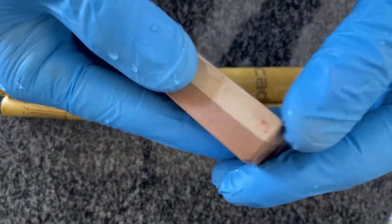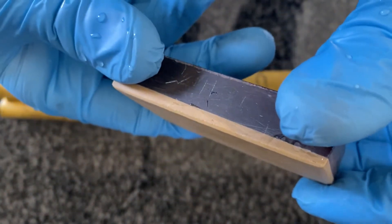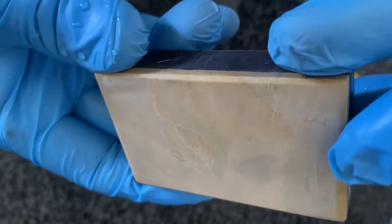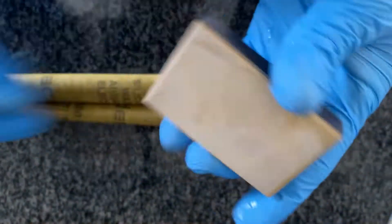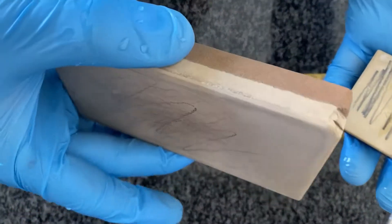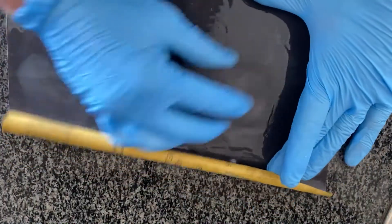That's how I maintain a stone. I want to show you this small little cuticle stone — you'll see how the bevels are nicely on here, even these edges here are rounded off at the bottom of the stone. Now the stone I was working on is very hard — it's a synthetic stone. This one is a natural stone, so on the wet/dry sandpaper it will cut quite quickly.